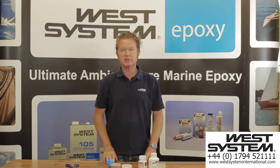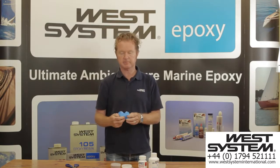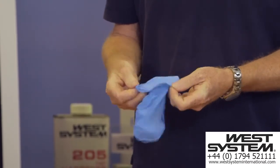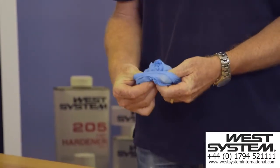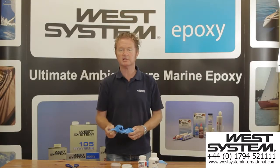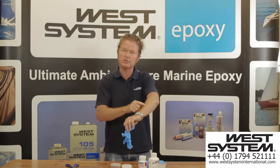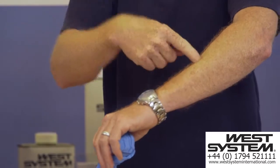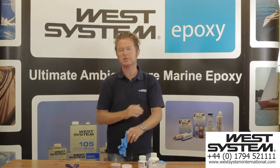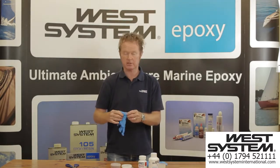And the first thing that we would want to do is prepare ourselves for working with West System epoxy, and that involves wearing some durable gloves. Very important to avoid skin contact. If you do get skin contact with the resin and hardener mix, it's very important that you don't clean it off with solvent. If you use solvent, it will force the resin and hardener back into your skin. If you get epoxy on your skin, wash it off with copious amounts of soapy water or our West System hand cleaning solution.